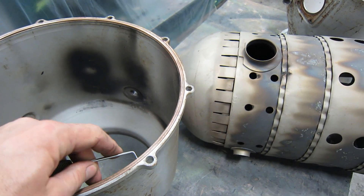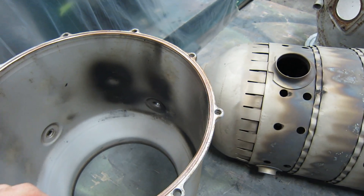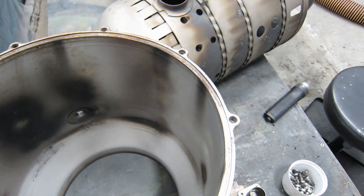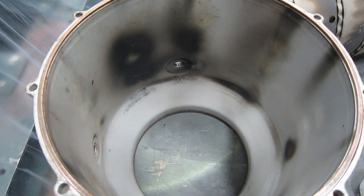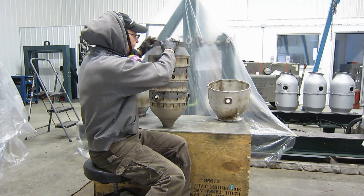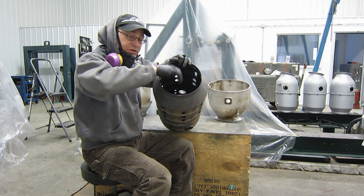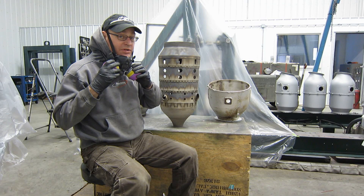These combustor cans have a joint halfway through. This is a copper sealing washer, just intended to seal the compressed air in the combustor chamber. Any leakage here would be a loss of power. So there's a nice copper crush washer that keeps all your compressed air working to feed energy to the turbine versus blasting out the split line wastefully. All the deposits around the outer wall of the liner are inconsequential - they don't make any difference whatsoever. But up near the dome near the top there's a lot of soot. We're going to brush it out and blow it out with compressed air. Because it's dirty, disgusting work, I'm going to be wearing a respirator so I don't breathe this stuff in.